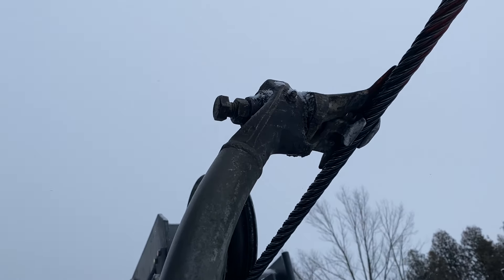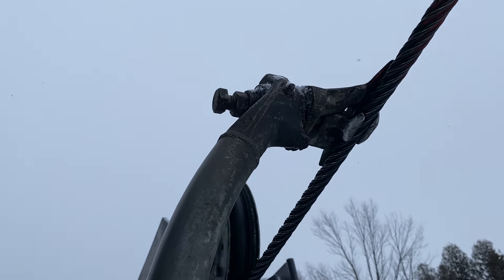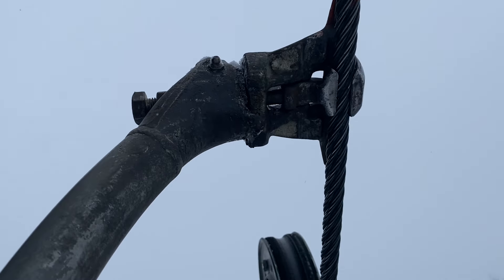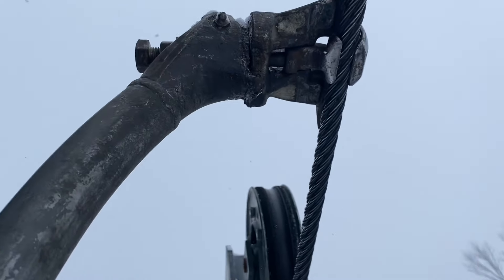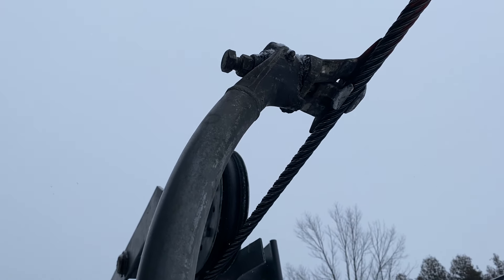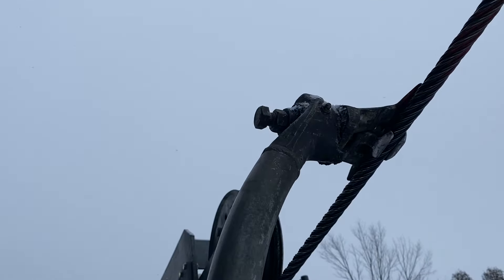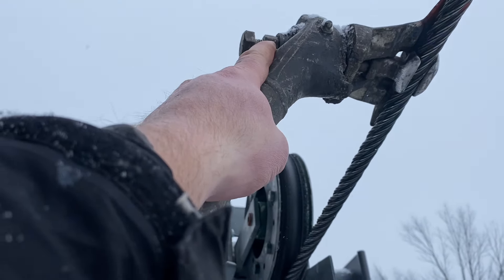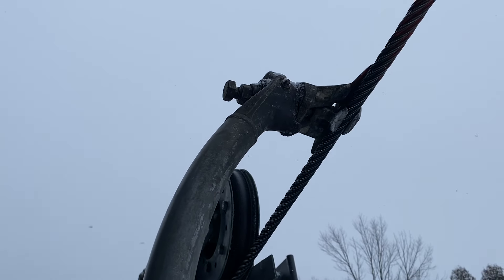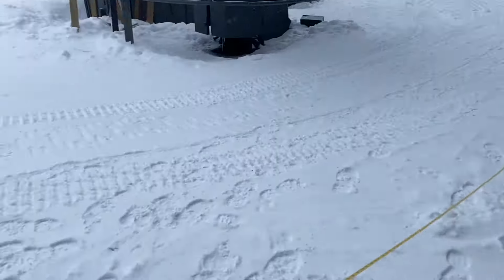The idea is basically the same as the chair lift, with the major difference being there are no springs in this one — this bolt actually pushes on the pin right here and that applies your force onto the jaw. For these, 23 foot-pounds is the torque value and that holds them in place; they really don't move much. All I'm going to be doing is break the jam nut back, loosen her off, put the new one on, torque it to 23 foot-pounds, and away we go.